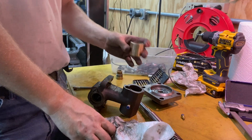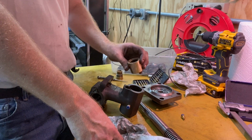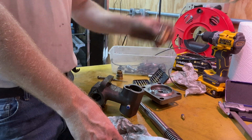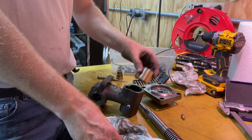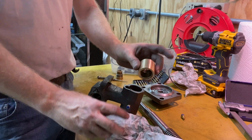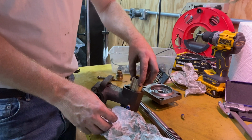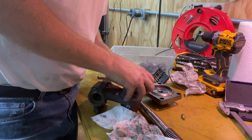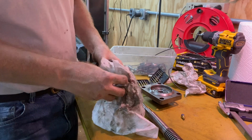Okay, this nut was really fighting me. I was having to hammer it in and then hammer it back out, and I'm like, that's not gonna work, because I need it to slide so that when I'm doing my tensioning, I can tell where it's tense and not just fighting the nut. So I put this in my little mini lathe, used some sandpaper, just polished it up, and now it slides in there just very nicely. Still really good fit.